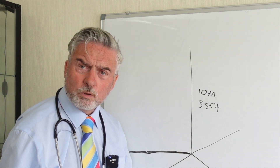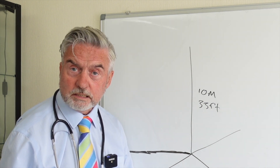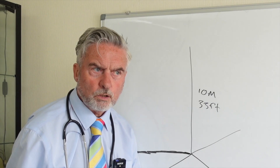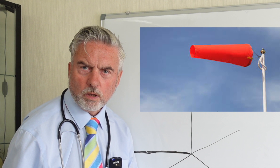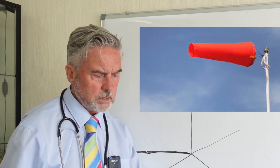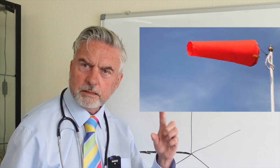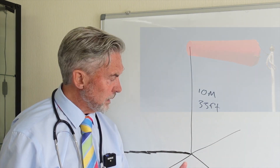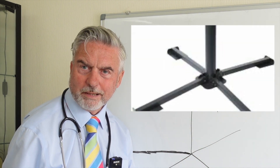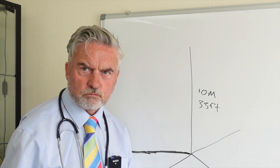It will also work reasonably well on 20 metres — great on 20 metres with an ATU. For the vertical, you need to get a flagpole or air sock pole off eBay. I'm not going to put links, you can find them. They're the ones that are quite thick with fibreglass at the bottom, tapering off, thin at the top. You have to find some way of supporting it on a fence or on a parasol base or something like that. Stick it up in the air and you'll get good results.